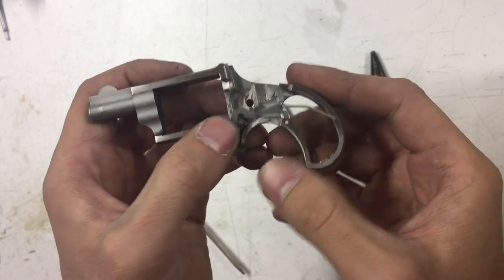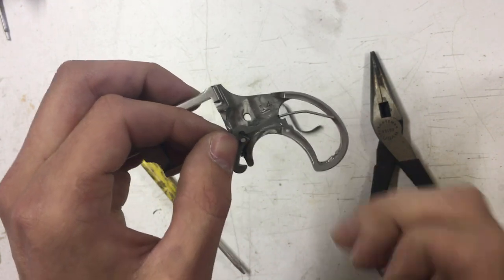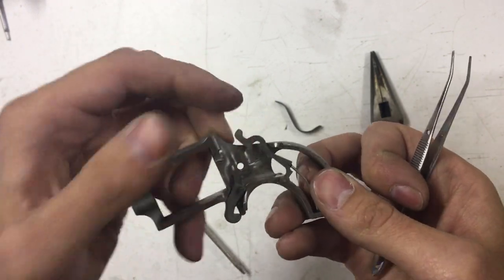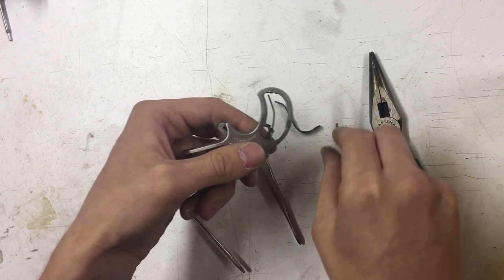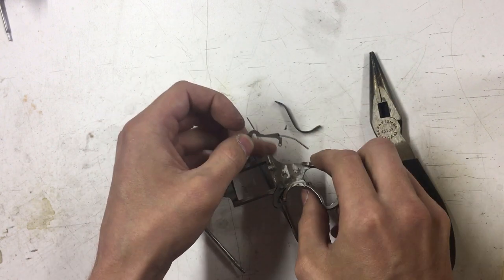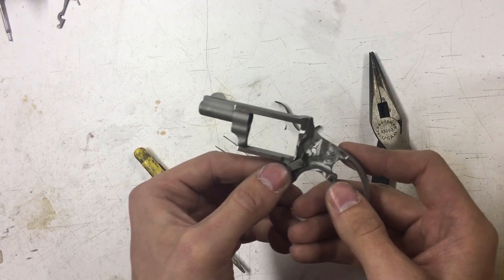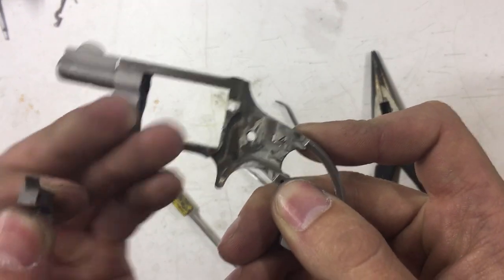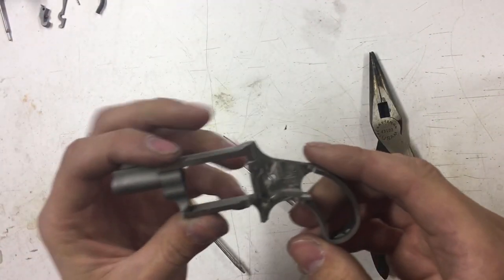There's a pin in here that's just loose — just leave it alone. The best way to get it out is to get pressure off this piece by popping this up, which takes a lot of pressure off, and usually you can just bump it out. That gives you your tiny little pin that goes with the piece holding the cylinder in place. Then the trigger is real simple — there's a little spring and it just pops up off that pin.